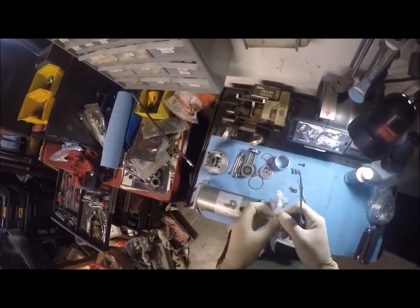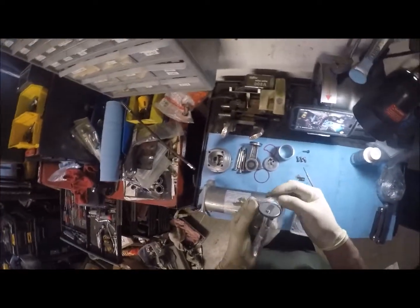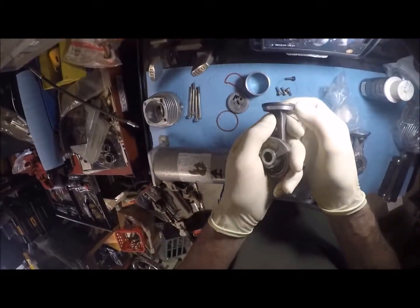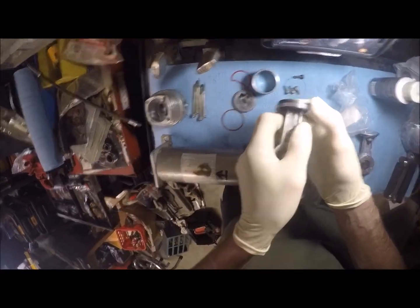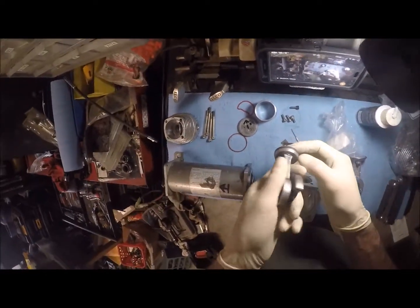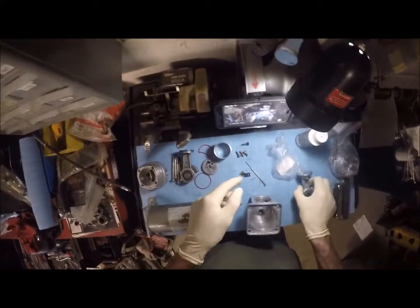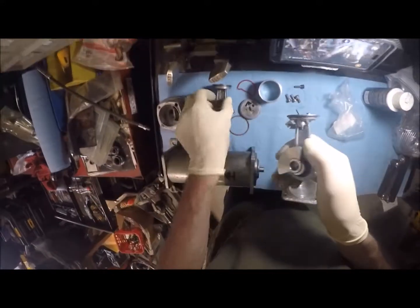One thing about these compressors is they're oil free, which, like any oil free compressor, there's a type of seal on these that actually lubricates itself. It has graphite as part of the seal, and this one here is pretty bad actually, come to look at it. But yeah, they pre-lube themselves. Although that one's still usable, don't get me wrong, it's not rubber. And this is what a new seal looks like. See how open it is?